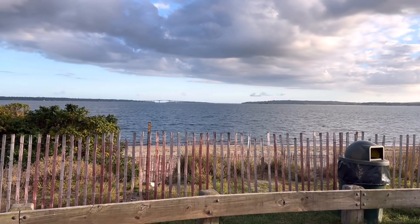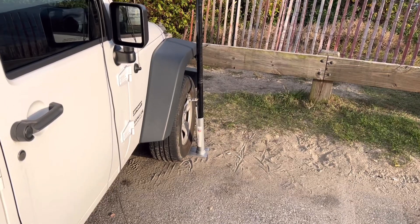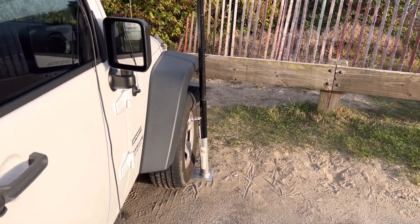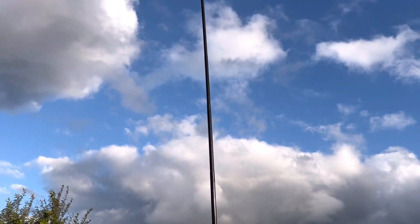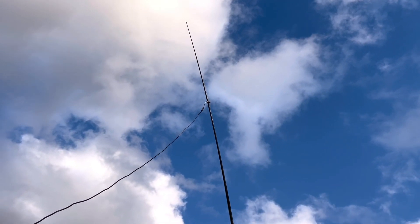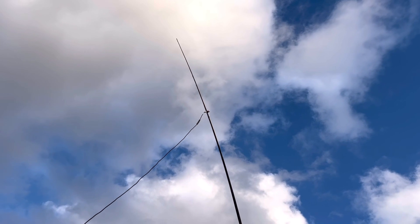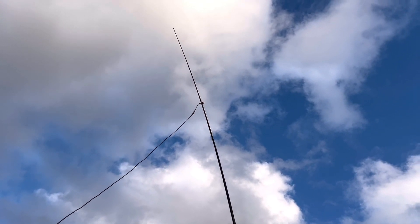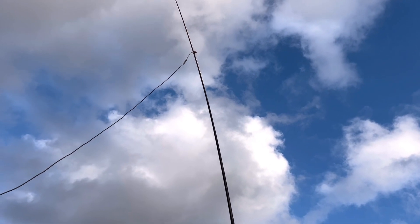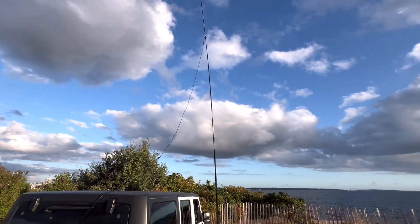Okay, here's the setup. That's Narragansett Bay, looking due south here at the very tip of Quonset Point. I drove over my little flagpole holder. I do have my little antenna spike to keep my DX Commander pole from tilting — just to keep it in place. There it is, the 10-meter DX Commander pole. If you look up there, the top element is taped, the banana clip is taped, and there's the choke on the coax. This is a Chameleon coax — 50 feet long with a choke at the end. Down to the lower element, also taped on. There is my vertical dipole for 10 meters.